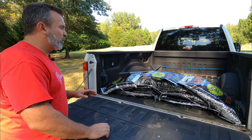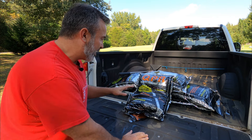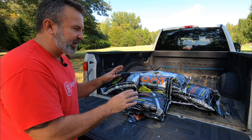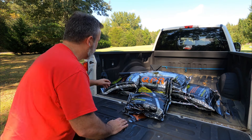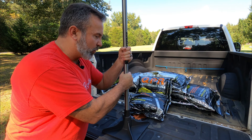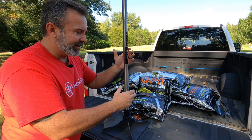What we got is QPR — Quality Pavement Repair. This is a cold patch material, a cold patch asphalt repair. It is permanent and fast. You can do it in wet locations and it is moist. It has a tar-like additive to it. We're going to set it down, pack it in place, and it will harden and adhere to the existing asphalt. One of the things I've got is a tamper — a 10 inch by 10 inch tamper. They had an 8 inch by 8 inch, but got to go big, right? I'm going to use this to tamp that asphalt flat against the pavement. You can make your own with a cinder block or a 2x4 with a piece of plywood with some weights on it — you don't have to buy the tamper.